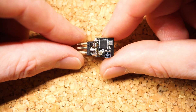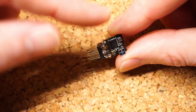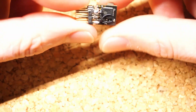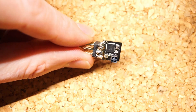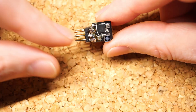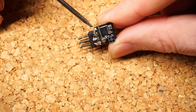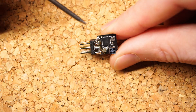As you can see here, we have the Happy Model EP2. Don't click off this video just because there's only three outputs. The hardware is capable of five outputs, and the code I've checked in is capable of eight outputs. There's only three outputs here because that's all the pads that Happy Model gave us. All they need to do is drag two more lines out and we can have up to five receiver outputs, though it would have to be about two millimeters wider.